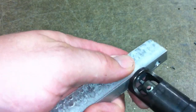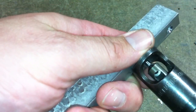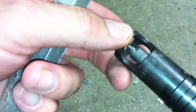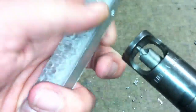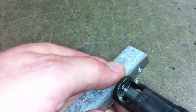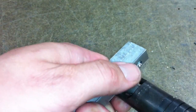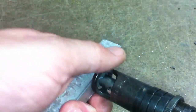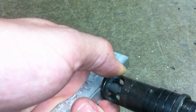In this application I have one set up for a number 30 with a single flute and the other one — a number 30 with a three-flute. So this one I'm going to turn faster and push very, very lightly on, because the single flute does want to bite into the material more. Let me try and position it so you can see.